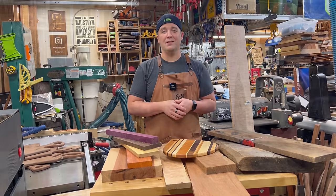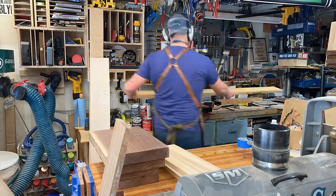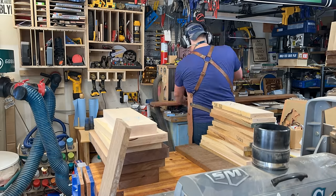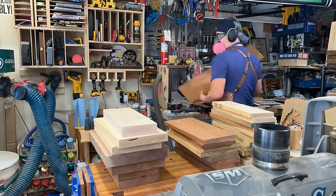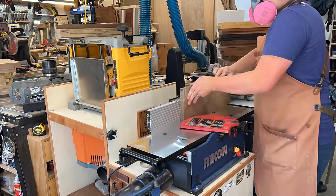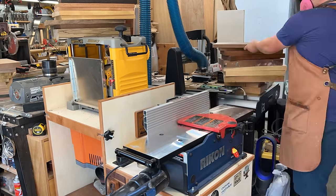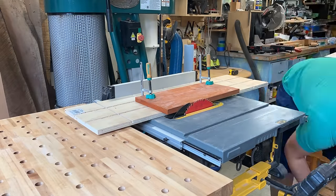My first step is cutting boards to length. If they didn't come pre-surfaced or were rough sawn, you'll probably need a router sled or jointer. I like my boards to be about 12 by 18 inches and about one and a half inches thick. If I'm making an 18-inch board, I cut them a little longer — like 20 to 22 inches — to account for snipe, which we'll get into later. Here I'm using a little benchtop jointer, which saves some time and helps ensure nice glue-ups.